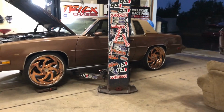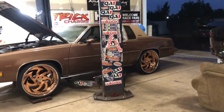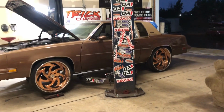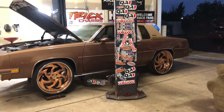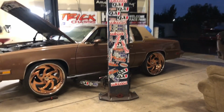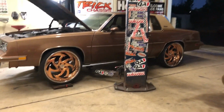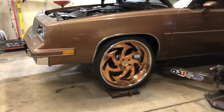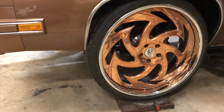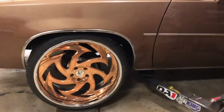These wheels do clear the frame and all that, but it's gonna get 7-inch lips on it, so I'll narrow the back a little bit. Little quarter rail notch in the back, so now I'm not gonna full frame notch this one. We already figured everything out, measured everything up, boom. Anyways, tire, touching the fender, a little bit. We have all this room towards the back.